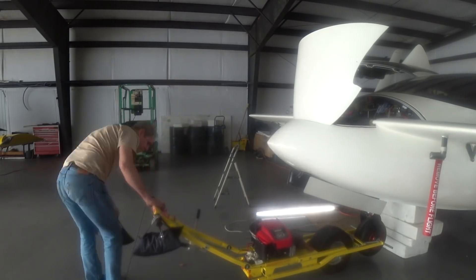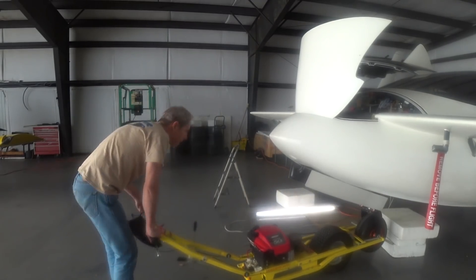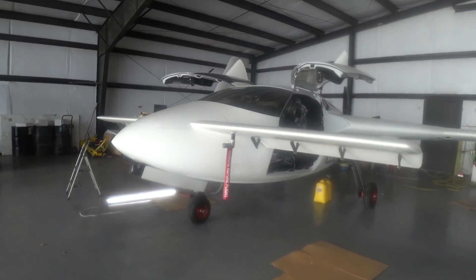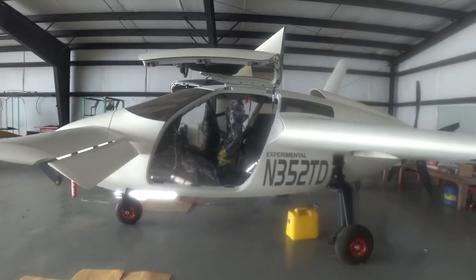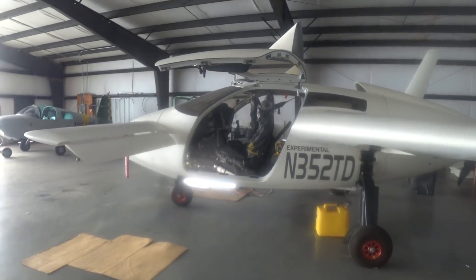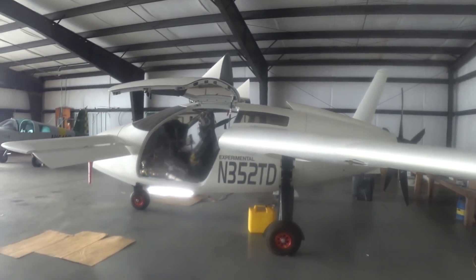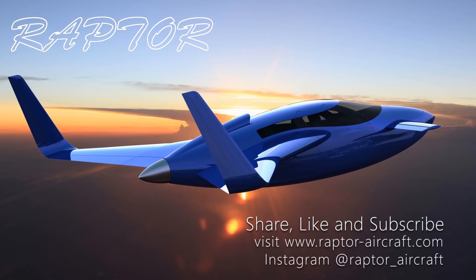This is how I get the aircraft back off the blocks — I just put my little 50-pound weights on either side of the nose wheel cut, and back on the gear. So that's how it all looks back together. The next step is to get that elevator balancing completed, and then we'll go from there. Tune in again on Tuesday to see if I got the elevator balancing finished off. Thanks again for watching — we'll see you next time.